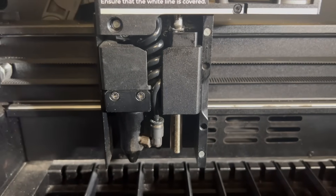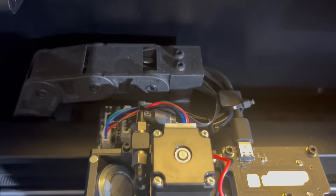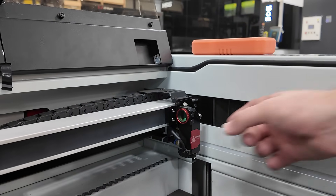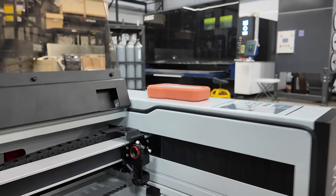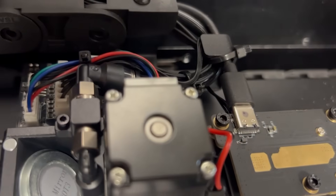The amount of service work is also a concern. If you go over to the laser head and try to remove the lens to clean it, you've got to lift a cap, and there's a bunch of electronic componentry in there that could get dirty — that's probably not optimal. It's not like other machines in the EON classification, where you walk over, pull the lens out, clean it, and put it right back in. Time is money. Another reason professionals stay away from it: if you strip the threads pulling that out, who wants to deal with that kind of nightmare?